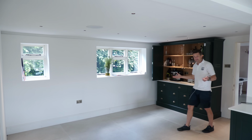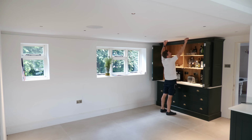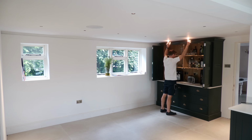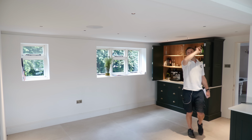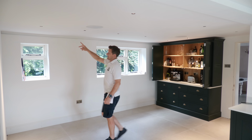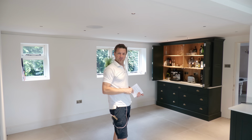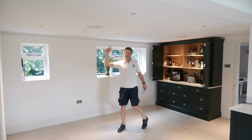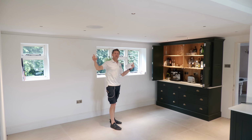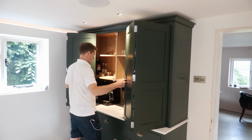Moving to this dining area, we've got the main circuit, which has two downlighters lighting up this pantry cupboard. Again, these are tiltable, which means you can have the light shining directly into the cupboard. And then on the same circuit, we've got another 1, 2, 3, 4 lights, which light the walkway, common area bits of the room. Circuit number 2, 3 downlighters on 20 degrees rather than the normal 30 degrees. They're just shining down to where hopefully the dining table's going to be.